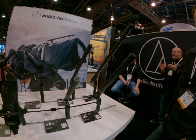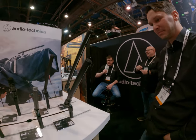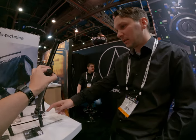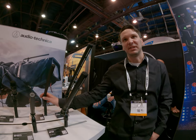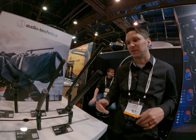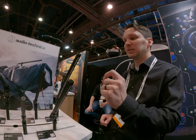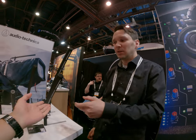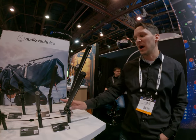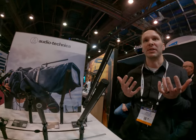These are also XLR, just a little bit bigger. These are actually a large diaphragm condenser shotgun microphone, so the capsule itself is bigger. Small diaphragm condensers usually have more noise, so these are lower noise and higher dynamic range — quieter, picks up quiet stuff better. And the larger size means it's going to pick up more low end or more bass.